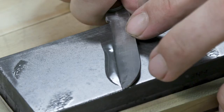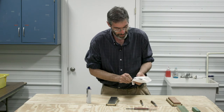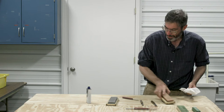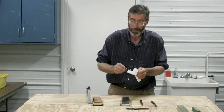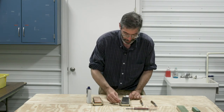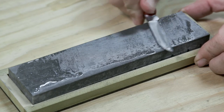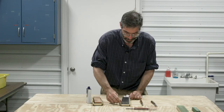Once you're done with that, you should have a slight amount of metal shavings on the surface of that blade. Then wash the excess oil off the blade — you can use a piece of towel. Before stropping, we're going to go on the other end, because when we sharpen there's a slight curve of metal on the back. We can go along holding that blade flat and push it backwards along that stone to take that metal edge off.